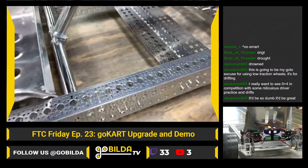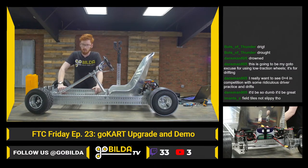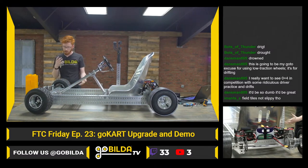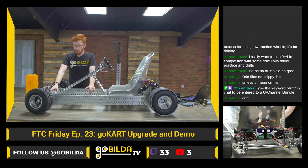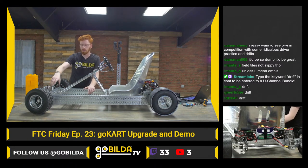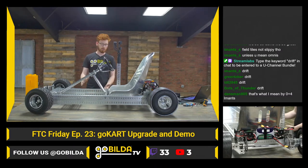Now, the construction of this chassis, I'm sure you've noticed, has a lot of boxed U-channel. This is a method of construction we use a lot for our heavier duty, really large scale projects, and it can emulate a 2-inch by 4-inch box channel. Using some threaded plates and standoffs, you can mount these two full U-channels back to back and really get a ton of strength out of them. And they really are much stronger.